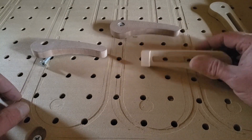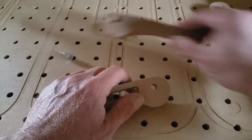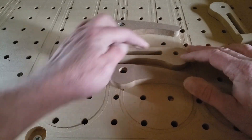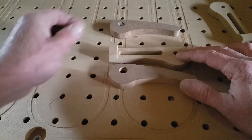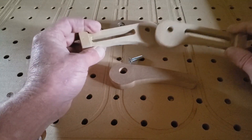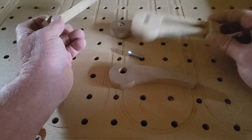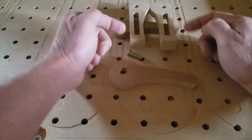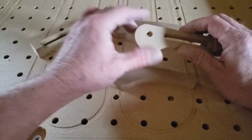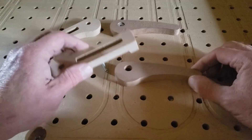I really don't know why I haven't seen anything like this — I've seen this part and I've seen that part; I just don't see why you can't put them together. If you want to cut a groove or pocket down here so that your screw will sit down further, that's perfectly fine to do. You've got two different directions that they can go. If you only want to use one, you just mill that one — they're both identical as far as the straight edges and pocket length. They both still have the hole, so if you just need a cam clamp, that's fine. It's still got enough meat on it to hold something pretty sturdy without having to worry about it.